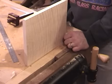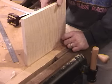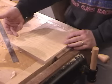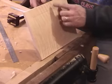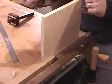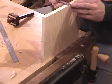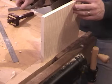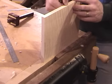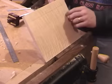There's a couple different options for hand planes. A shoulder plane, a real wide shoulder plane, will work really well. In fact, I'll start up here along the scribe line, just basically decreasing the depth of this outside field to whatever I want my fillet to be. In this case, I'll probably use a full 16th, maybe even 3/32 for a fillet depth.